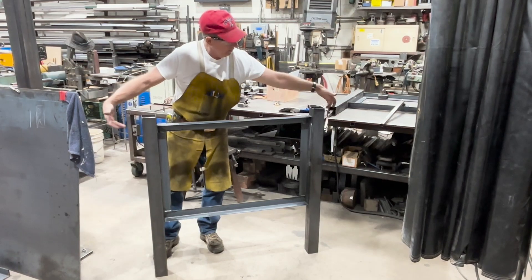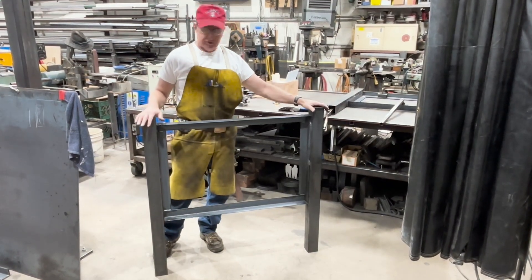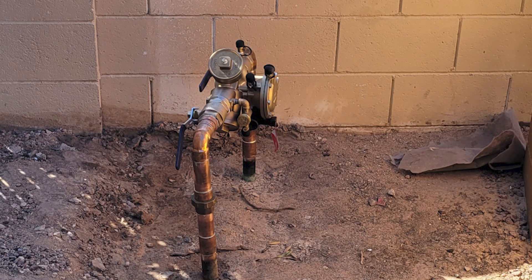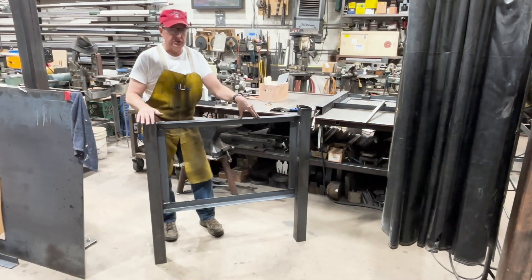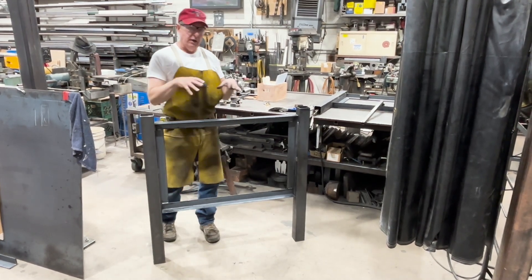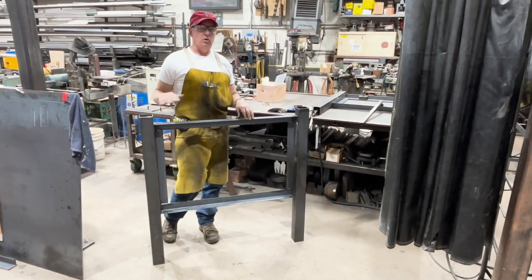This is the start of it. It's going to have a three by three tube that he's eventually going to fill with concrete. We're going to essentially make a cage that he can then put over the backflow device. We're making the two sides and then I'm going to stand it up three dimensionally and then add all the sheet metal and build the lid.